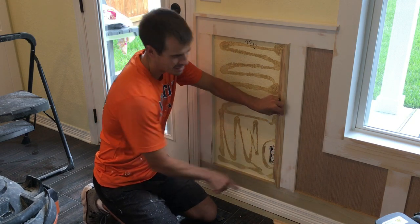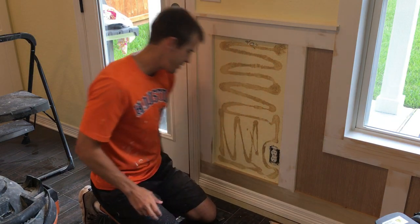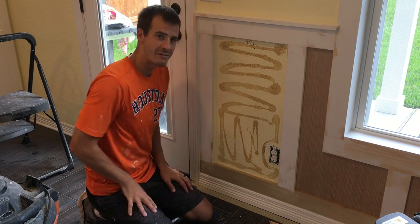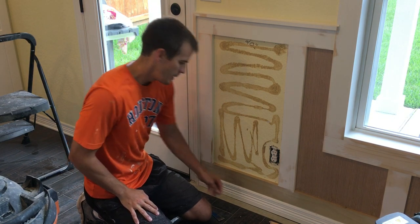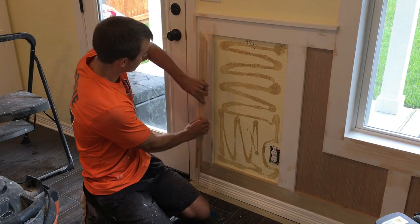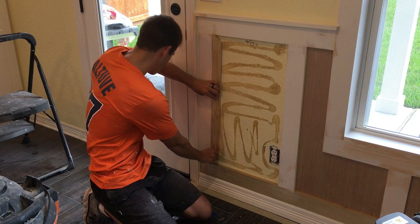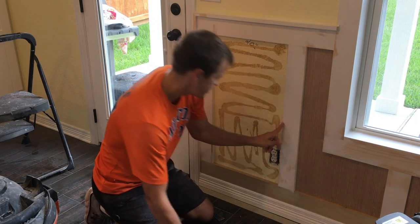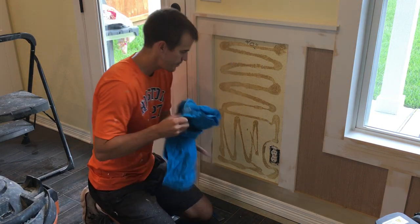So obviously, I got a couple of options. I cut the molding here. That's gonna look horrible, so I'm not doing that. I'm gonna do it the right way. Took my piece of plywood off. It did not come off easily. You can see I damaged this style here. But with the amount of overhang that I have with this panel molding, I will be completely covering up the damage made, so no harm done there. Also damaged this side, but that liquid nails is holding pretty good, so that's a good sign.